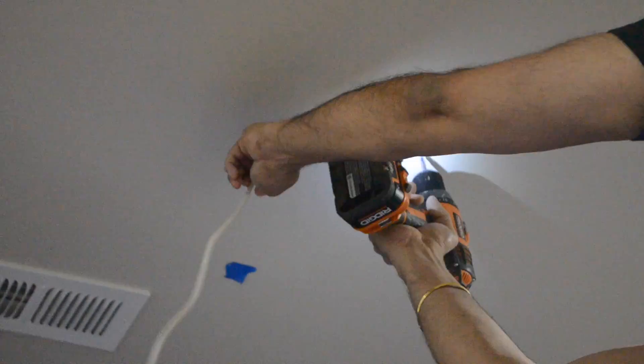It's time to start the cutting process. While cutting, try to keep your knife straight and stick to your markings. It's better to cut a little less the first time and have to cut more later. Be patient with this. Then we can slide the electrical box in and screw it into place.